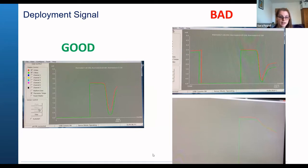When running the sensor inside, the good signal is what I want you to get used to. You would be deploying the sensor from the sensor control with the two different wavelengths selected — the red one and the green one. If you have a good signal, your peak will be around three volts or 3.5 volts. As it proceeds through the state machine, when the dye is injected into the water sample, the signal will go down because the dye is colored, so there's less light. Then the signal will come back up to its original point around three volts. The sensor is having issues if the signal doesn't come back up to three volts, or if you don't even get the trough.